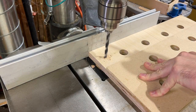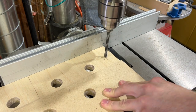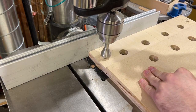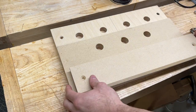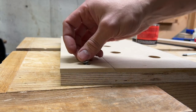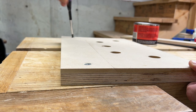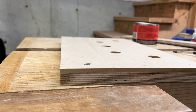At the drill press, drill an appropriate size hole for the threaded inserts that you're using. Offset the hole location approximately a thirty-second of an inch up from the mark made by the brad point. Countersink the holes in the plywood to make sure the threaded inserts don't sit proud of the plywood surface, and countersink the screw holes in the MDF inserts as well. Once the threaded inserts are installed, you can test the fit. Notice how when the screws are tightened, the offset holes cause the seam between the insert and the upper piece of MDF to become flush and tight.